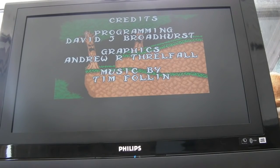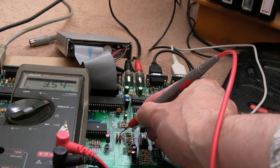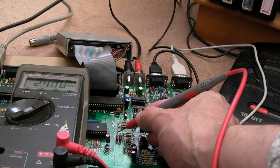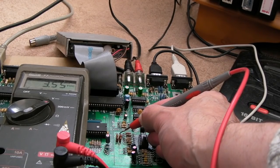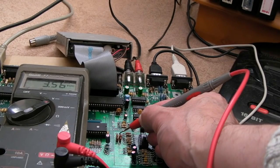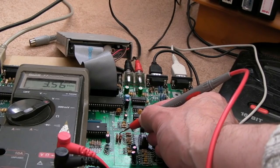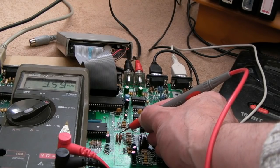So testing there — no distortion, because clearly it's not warmed up enough. You can just about see the voltage there. Let's just measure those two test pads again — the right channel's still high: 3.5, maybe it's going up. When it goes up to a certain point maybe that's when it starts to distort. The left channel's all right. Yeah, you can see it's just gradually creeping — it just went 3.59 there. 3.57, looks like it's going up — 3.58, 3.57 — so it may start glitching soon. At least you'll be able to get an example of how it's distorting.